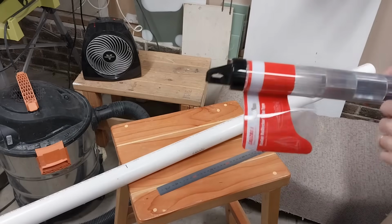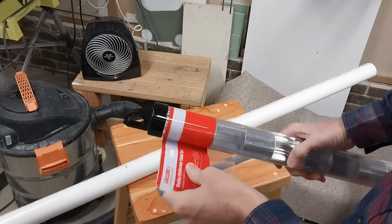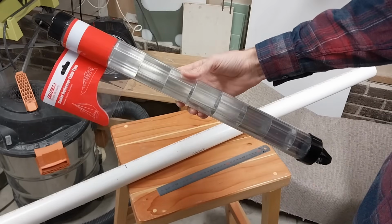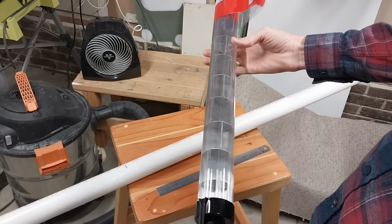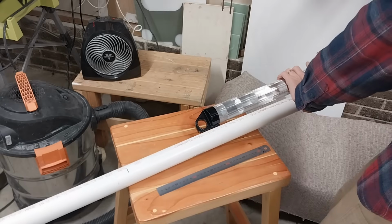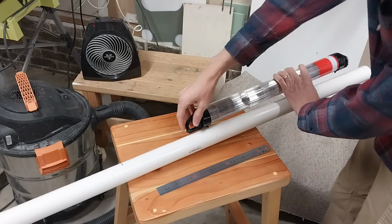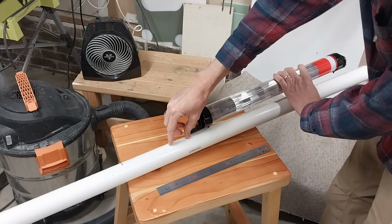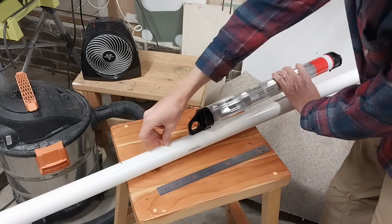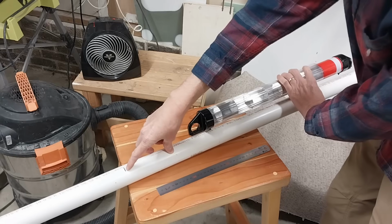All right, for the anchor light tower, my dad bought me this radar reflector tube. If you're not familiar, this is supposed to give your boat a better radar signature so other ships can see you easier. We want this about 2 inches or 50 millimeters from the top. It's 600 millimeters, then another 50 millimeters to the housing. The housing is 140 millimeters, so that gets us to here. I think that'll be a good height.